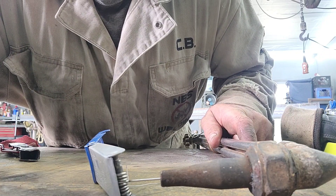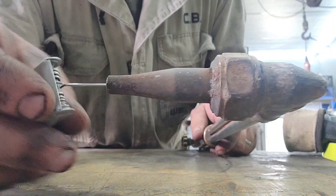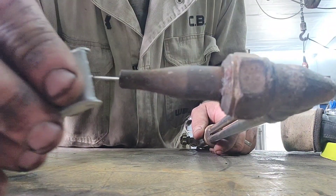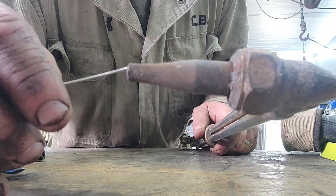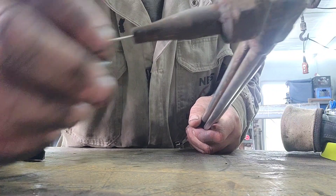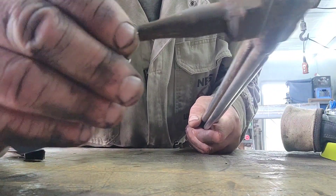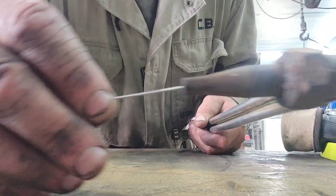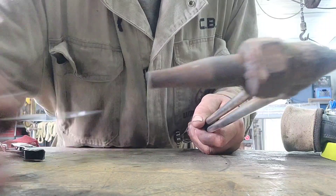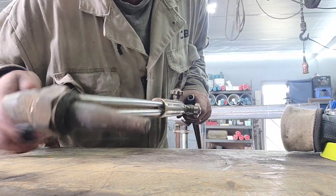You pick the right size wire tip cleaner, like this. You'll feel just a little bit of resistance while you're cleaning. Blow oxygen to blow that debris out, so you're not just pushing it back in the way. Okay, we've cleaned our tip.